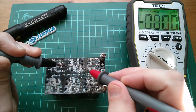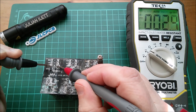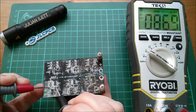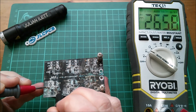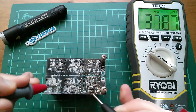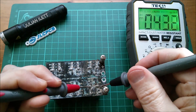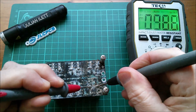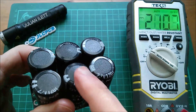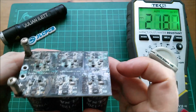That one is 3.7 - that's bad. The protection circuits haven't been doing their job, and hence that one's all puffy. This one is half a volt. On this side, we've got nothing on that one. This one is also puffed up - also at 3.7, which is bad because these are 2.7 volt capacitors so they clearly don't like 3.7. There's a definite conical shape to the two middle ones, both measuring 3.7, while all the others are flat - in more ways than one actually.